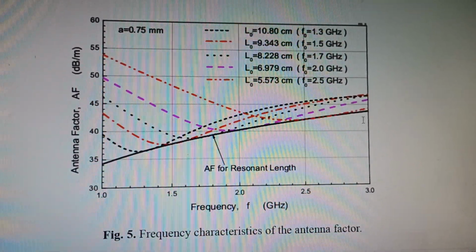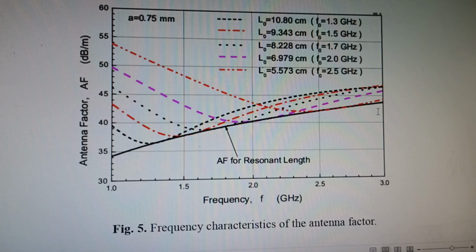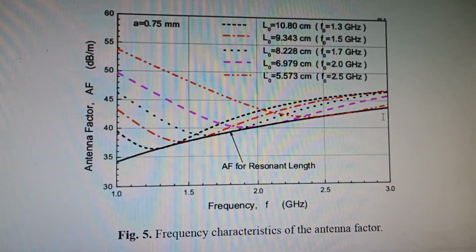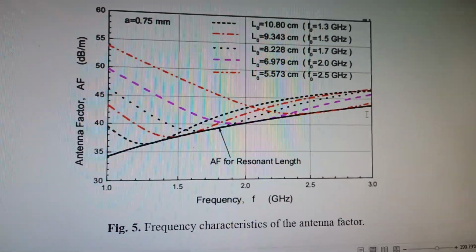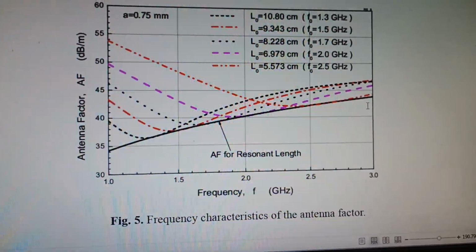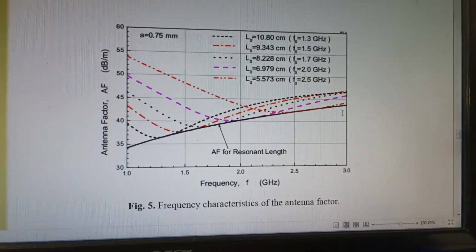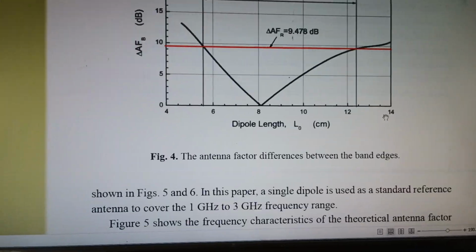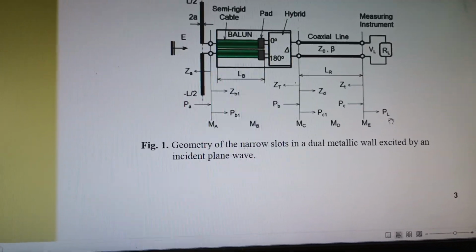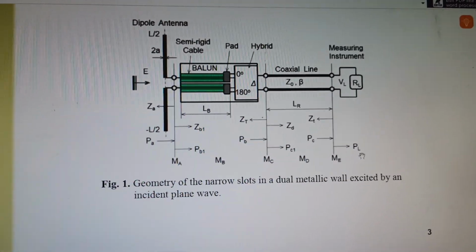Now, the only reason that they go to this trouble is for making field probes for antenna testing, and these probes are horribly expensive. A low-end E-field probe is $2,000. So it pays to pack some bandwidth in these probes. In amateur radio, we tend to work on a frequency or fairly narrow frequency bands. But there's research and testing on something called spread spectrum, which may bounce all over the place, frequency hopping. So it pays to have something that can test over a broader frequency range. But this has absolutely no validity in amateur radio. This kluge has a purpose only for antenna testing. This is not an antenna itself.